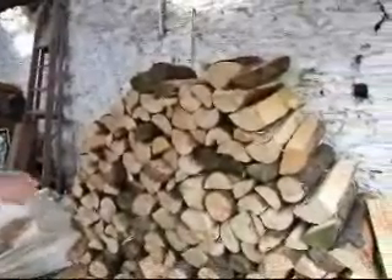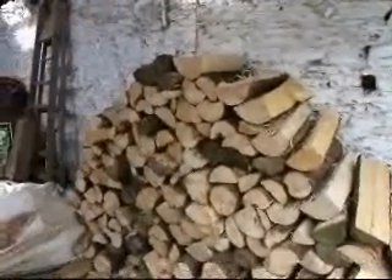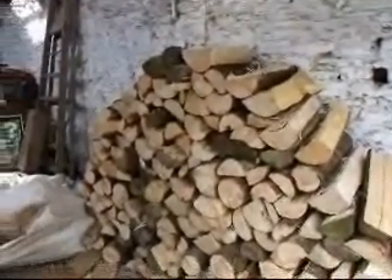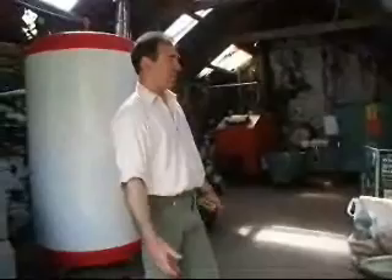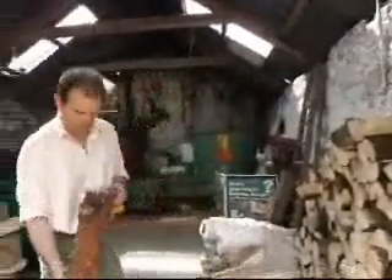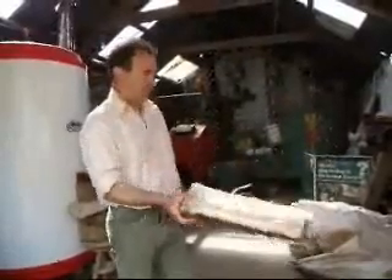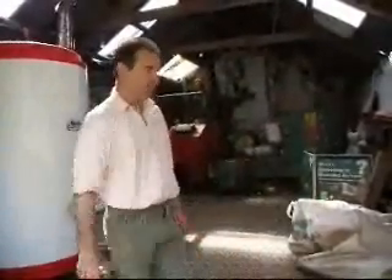These boilers need to run on logs which are drier than 25%; 20% is ideal and you get a nice burn. What I'm burning here is pine wood — this is out of the woods, and it's very cheap to buy. The cheapest way is to buy a lorry load in and process yourself. That way you have control of your drying process. The length of the log — you can cut them up to 18 inches. It's a good handy sized log to chuck in. You'll burn about a large wheelbarrow load every 24 hours.